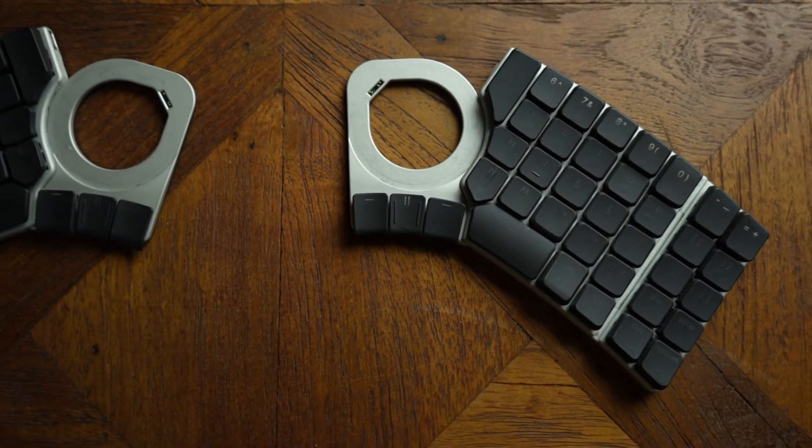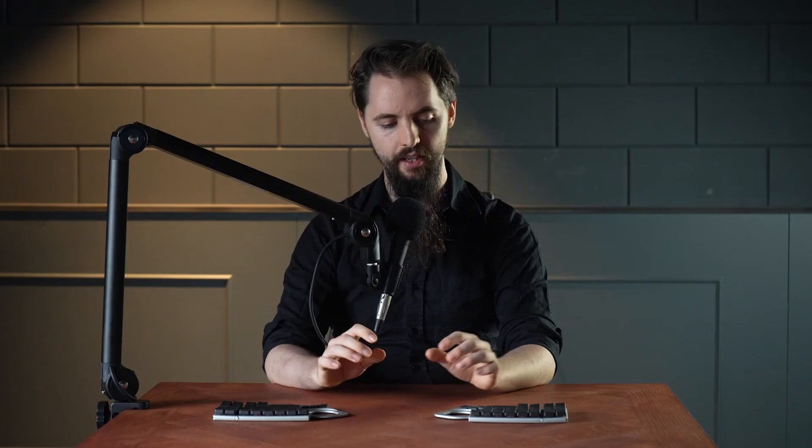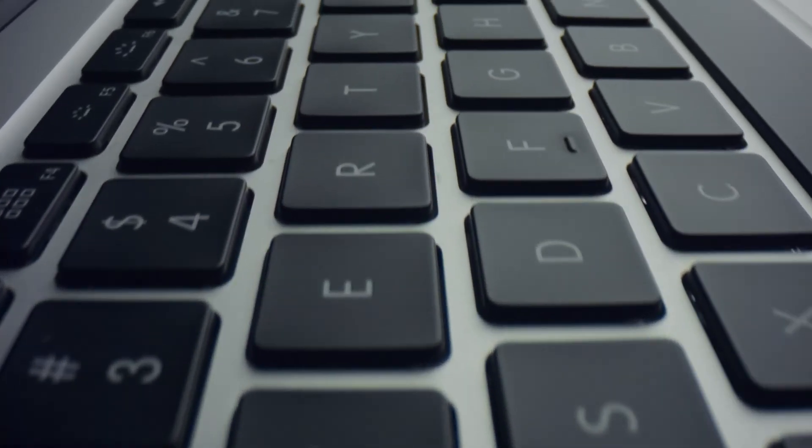We had to strike a balance here. We made our own keycaps, sculpted the key tops, and shaped every key so it easily fits and falls into your hand. This is also why we didn't integrate a key well, as that allowed us to individually tune every single cap directly where we needed it without adding bulk. We reduced distances vertically and kept the horizontal ones the same for the main home row, then reduced them on the outsides. That allowed many keys to come into range that would otherwise not be, while keeping the main key cluster free and very easy to reach.